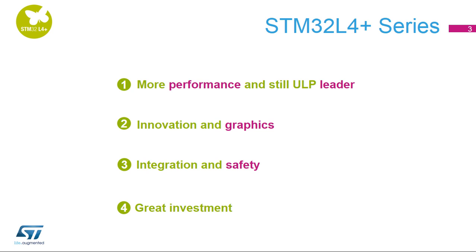There are four major points that characterize the STM32L4 Plus series. ST has stretched the STM32L4 architecture to reach 150 MIPS based on its ARM Cortex M4 core with FPU and ST Art Accelerator at 120 MHz while keeping best-in-class, ultra-low-power figures. Innovation and Graphics: enhanced graphics acceleration and innovative peripherals are embedded to optimize the BOM cost. Integration and Safety: 2 MB of flash memory and 640 KB of SRAM with safety and security features, smart and numerous peripherals, advanced and low-power analog circuits in packages as small as 5.2 by 5.2 mm.